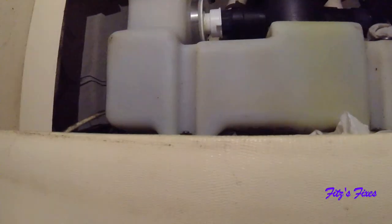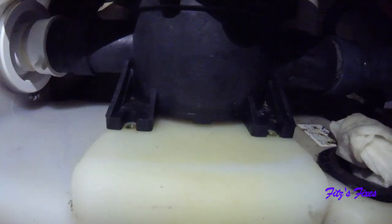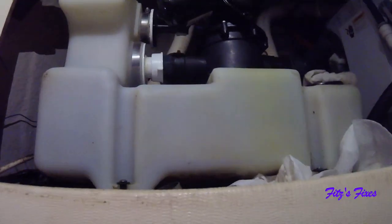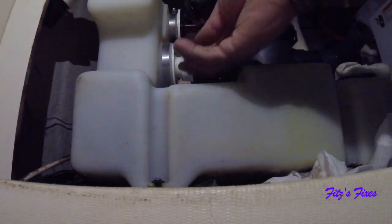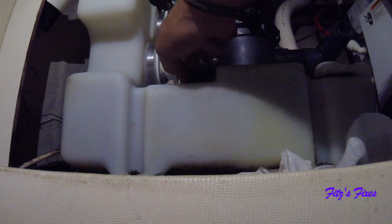On my particular pump here, my vacuum pump, I pull the bolts out - you can see they're on sliders, you can just slide the motor back. What I want to do is unthread this coupler and that pushes the motor away now that there's no bolts on it. Then I can unhook a couple wires up here to free up the motor and get to the duck valve in there. As you can see there's probably a little bit of stuff still in there, so it might be a little nasty.